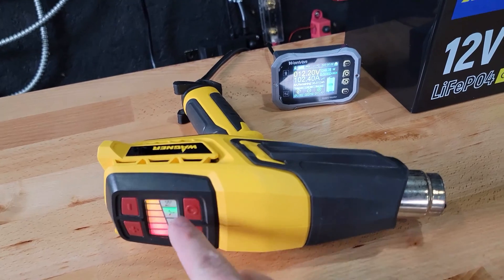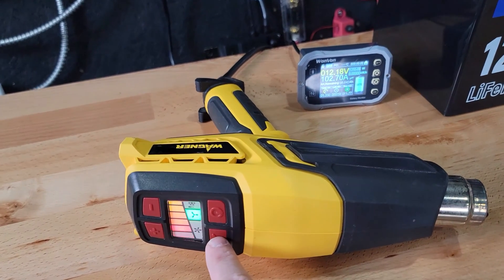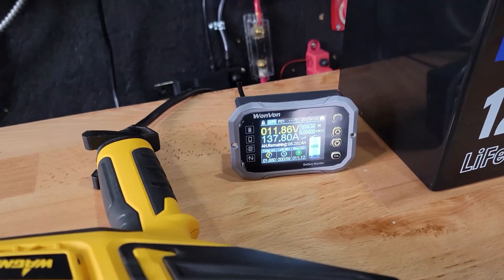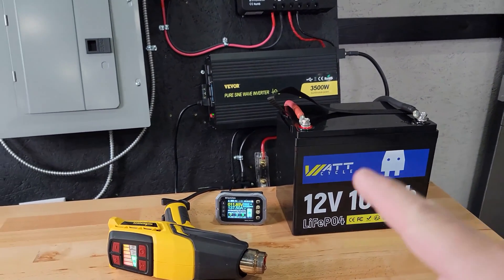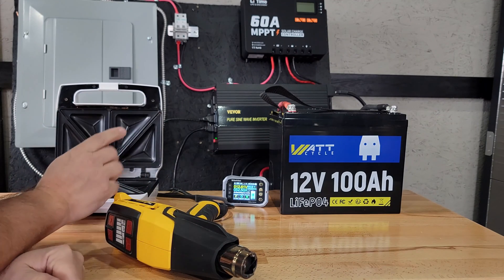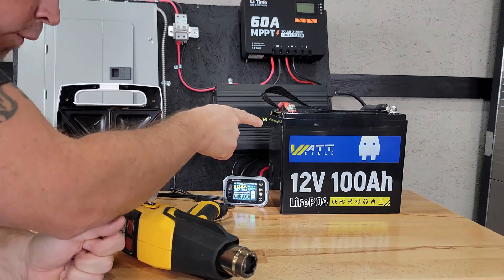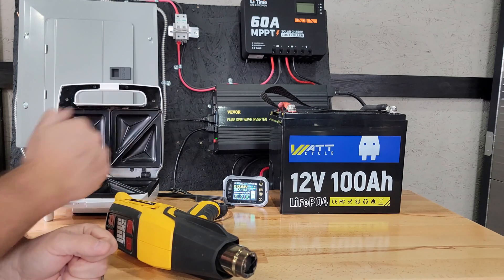On low fan we'll pull right around 100 amps continuously, but if we bump it up we get to 138 amps. Let's see how long the battery can take a discharge of 137 to 138 amps when it should only allow 100 amps. I ran it for five minutes at 136 to 138 amps continuously and it didn't kick off the BMS — it may not be enough over-current to trigger it. So we're going to try to get around 160 to 180 amps and see what happens.